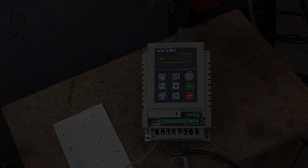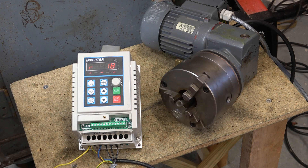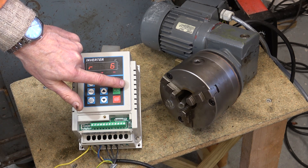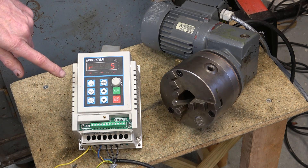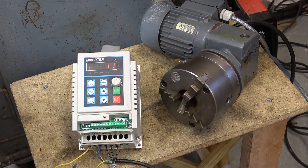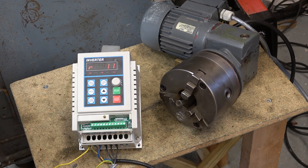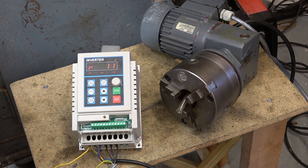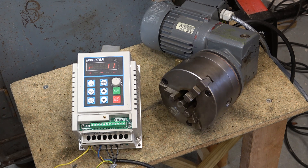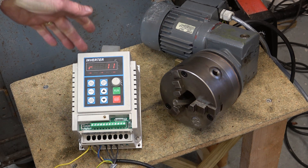Except my chuck's not turning. I've hit a problem: this runs happily at 18 RPM as you can probably see on the display, but as I reduce it down to around 5 RPM, it'll run at 5. Anything below 5, it just stops. On the other inverter I have, there's a torque boost setting which gives it more torque at low revs. There are torque settings on this inverter, but there's no explanation of what they do — it's not as simple as selecting torque boost like with the other one.